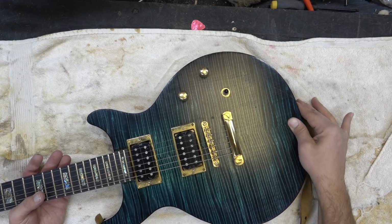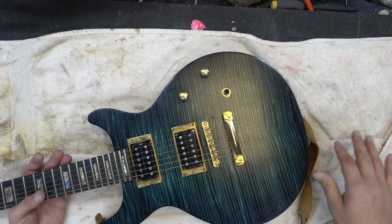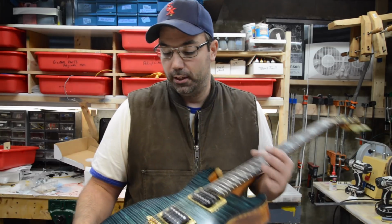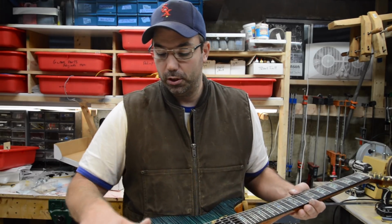And really, Tru-oil is one of my favorites. Lacquer dings and zings as well. But what's cool is you don't need any spray equipment. You can just come back, hit it, and get it nice and clean. And you really don't have any issues or worries other than a little rag and wiping it on. So 10 years on, still looking pretty good.